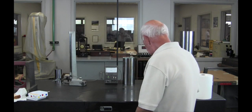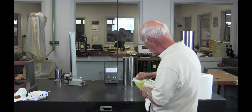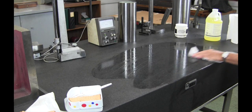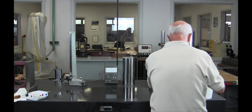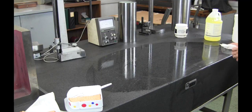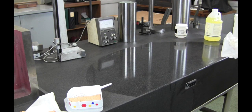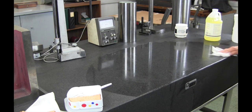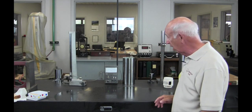Now I think we got it clean, but just to make sure we got all the PB&J off of there, I'm going to give it one more little shot and we're going to do a bigger area. In my view, this is the way to clean the surface plate — without the peanut butter and jelly. Now I'm going to show you what clean is. Do you believe this is clean, Glenn? Well, yeah, now it is. So you're saying that chemical stuff leaves a residue? That's right. This ammonia does not leave a residue. Once it evaporates, it's clean, it's gone. Watch.